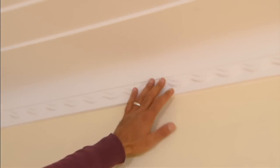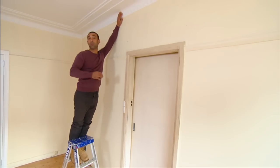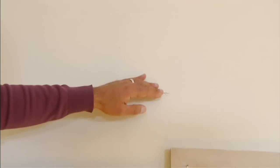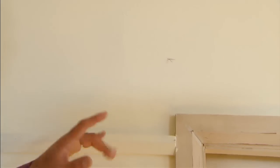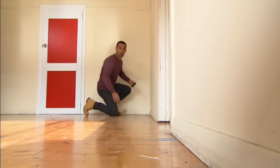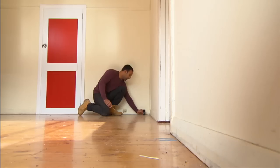I'm planning ahead — I don't want to damage the cornice or the picture rail, because you might be renting or simply one day you might not want the shelves here anymore. So I've come down from the corners and I'll have a nice shelf running the whole length of the wall, and around the picture rail I'll be doing a scribe joint. Another great feature with this tool is it works out volume and square meterage, so it's perfect for working out how much paint I need for this wall.